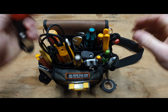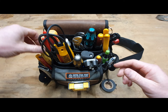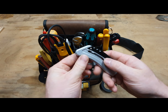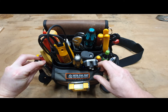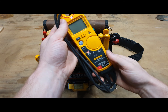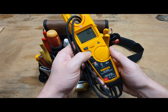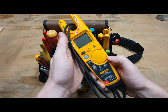The back side is here. A little set of Marvel needle nose pliers — really high quality. A Fluke volt stick here — this one's the always-on version, you check it with the button. I've just got a pencil knife — the best knife you can get, in my opinion. Best utility knife — little belt clip sits on there on the front. My tester is the T6 1000 — it's not the pro version. I'd like the pro version but I've had this like two years before it came out. It's a great tester, shows a voltage indicator light even if you don't see it or it's on hold. That's a common problem with these testers — it can be on hold, but that light will still come up if you've got a dangerous voltage. And continuity — it's a great tester overall.